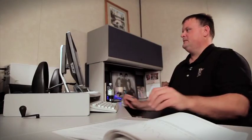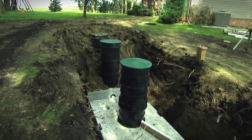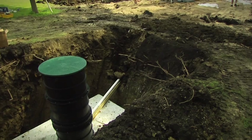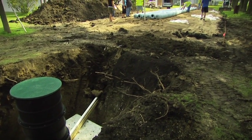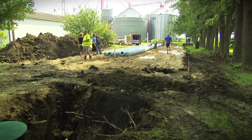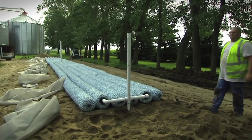It's very specific to your site — where your home is or where you plan to have a septic system or drain field. We basically look at both water table and percolation. By rule, we need to stay three feet above the water table in all cases. But in some cases, the topsoil or the soil the system could go in — be it six inches or a foot in the ground, which is general for my area — does not have the soil structure or a percolation rate that's acceptable. And that's where we're seeing mounds have to be built.